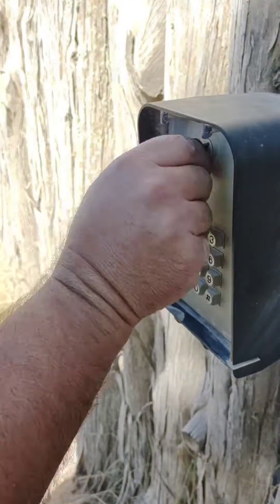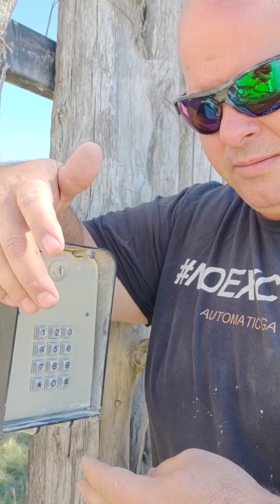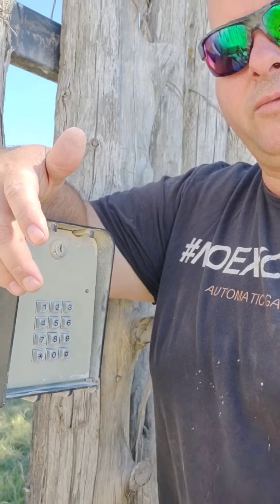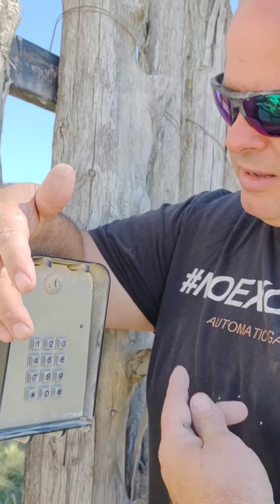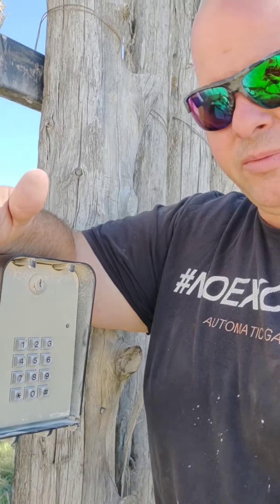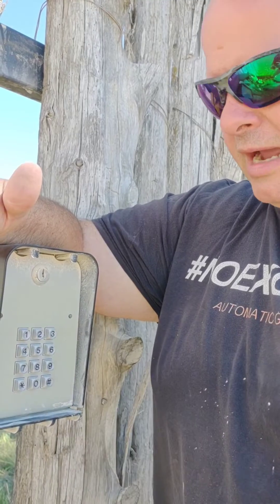That's another little tech tip. Box it up — you should still be able to hear it beeping, waiting for you to add your own programming code. In this situation the customer wants to use 4019. It beeps multiple times to acknowledge that, and the continuous beep every two seconds has stopped.